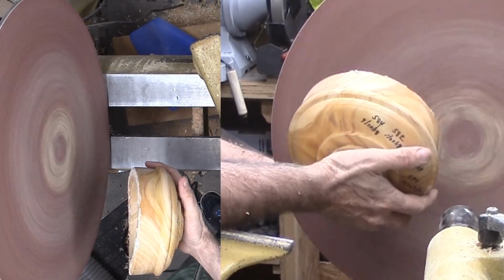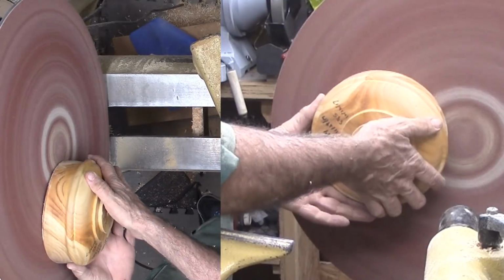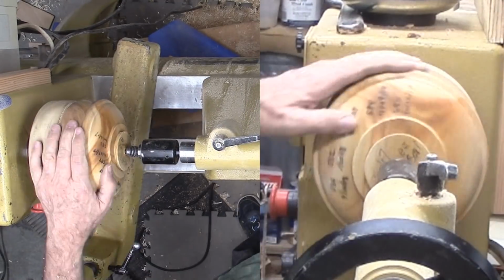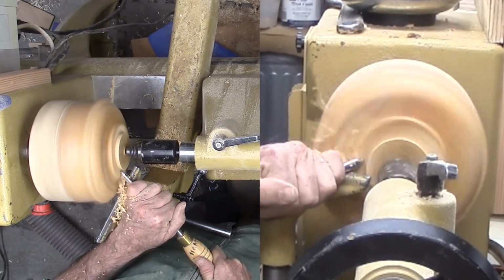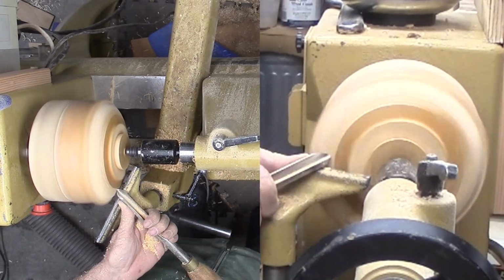The bowl has warped with the typical humps at the end grain. I'm sanding the rim flat again with my 20-inch disc on the lathe. Now with the bowl pressed by the live center against a faceplate, with the live center in its original position, I can work on the exterior again. Did I leave enough wood to accommodate the warp and still get a good result?